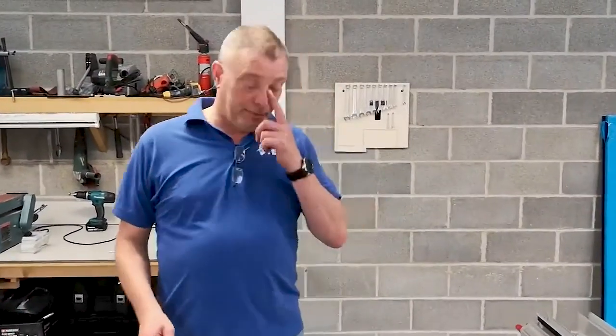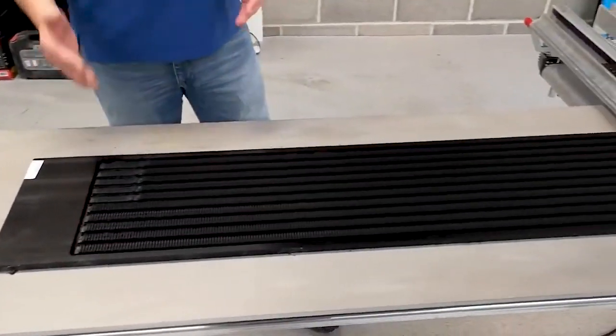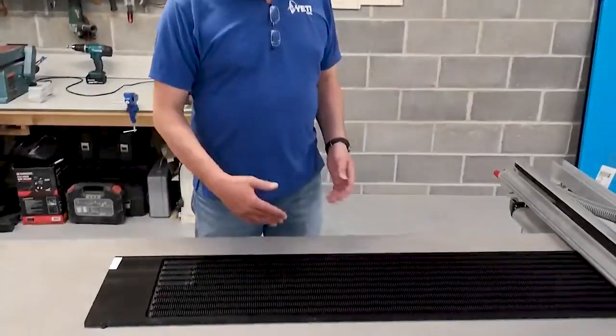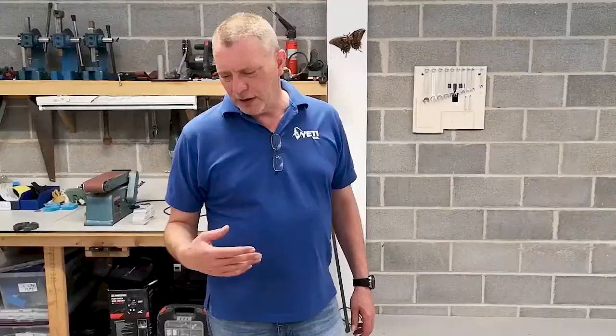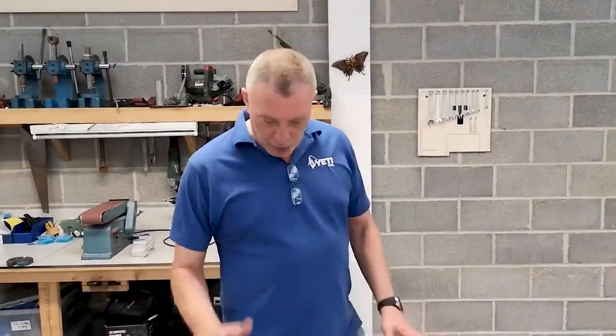This example of medium-sized workholding is a 12mm acetal. It's about 300mm wide, which is circa about a foot. It's a great project to demonstrate how we clamp medium-sized workpieces because we're cutting the full surface, so we're setting up SmartBench in a particular way that enables that. Basically we're using a Corian spoilboard here, because it's actually a little bit more dimensionally consistent rather than wood-based products — moisture can come into that.